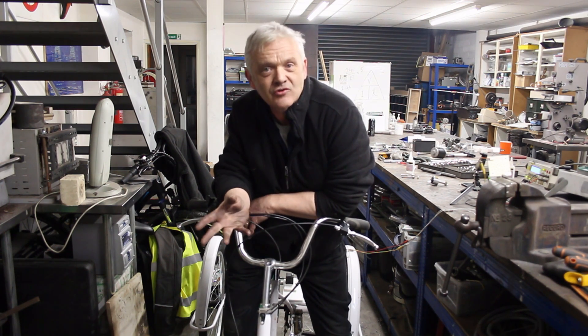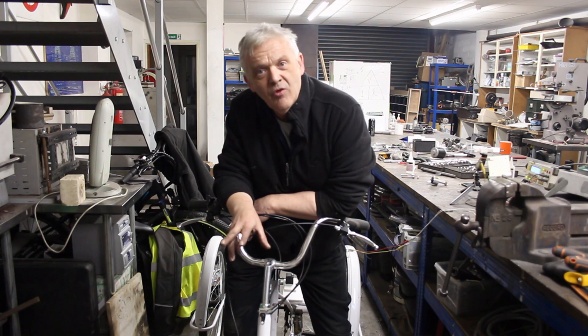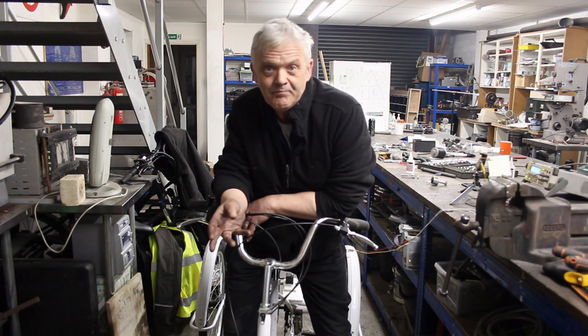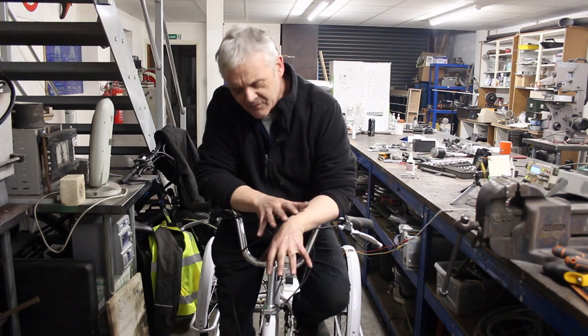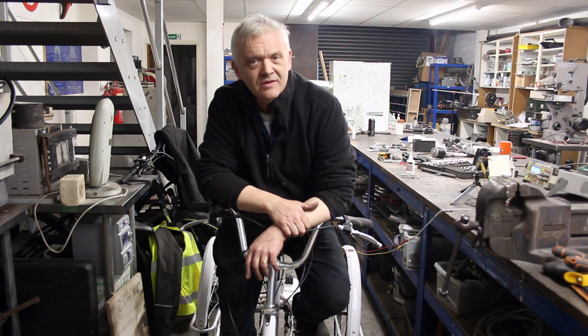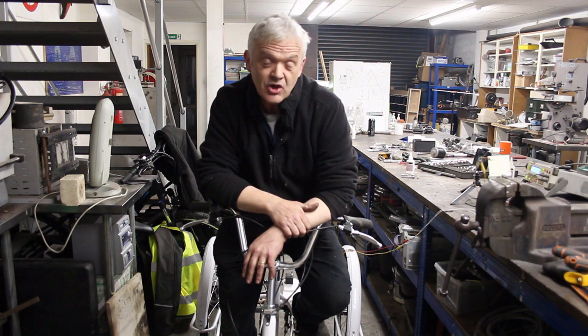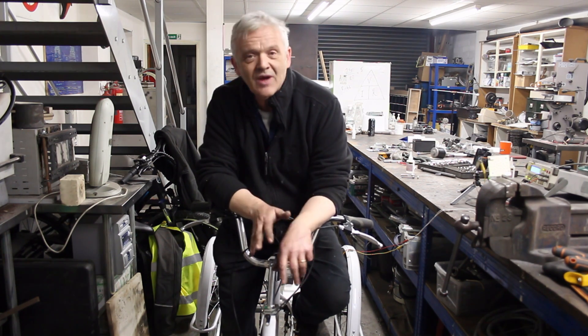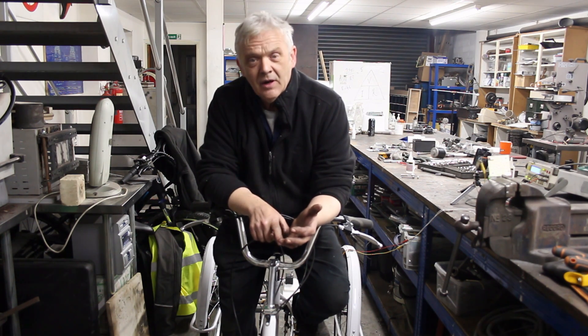Something like this will max out around 160 watts because that's what you've got in your legs. You're the power source, and you can produce that amount of power. The effort required is obviously a lot less than the hand crank generator, which took real arm strength — this uses your legs, so it's so much easier. It's also easy to adapt a bicycle to produce something well capable of charging your phone or battery for emergency power.